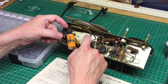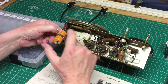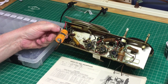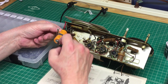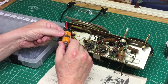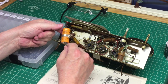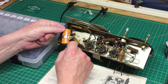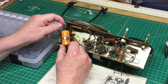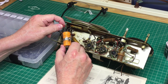I cut the strap that was holding the electrolytic down into the chassis itself. This has been replaced at some point in time. The schematic calls for a dual electrolytic capacitor — 40 microfarads on each side rated at 150 volts — and I'll just go back with 160-volt units. What we have installed: the red section is at 50 microfarads and the green appears to be at 30.